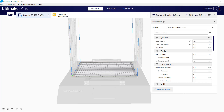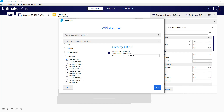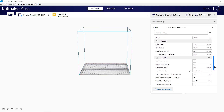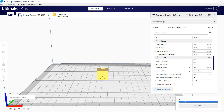Next, we will start with some simple prints like a test cube. I will use my own slicer and create a profile for this printer. Since there is no predefined profile, I will use the Creality CR6SE profile. The reason I chose this is because the CR6SE also doesn't support G29 in the G-code file unless you change to community firmware. We need to change the bed size — the print volume is 240x240x230 — and the retraction distance. Since this is a direct drive, we only need around 1mm retraction.